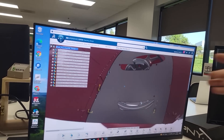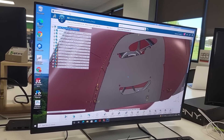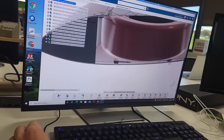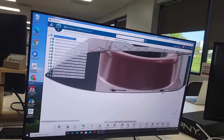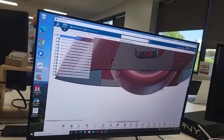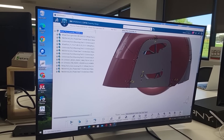There is a hole for the steering control arm, which is part of the current design, but it will change depending on where the steering link ends up in production. The exact locations of the attachments as well as the bracket connecting to the inside of the hub are still being finalized. We have found a set of quick-releasable ball pins that don't cost a fortune and should provide adequate clamping force. Final material selection will be dependent on engineering analyses.